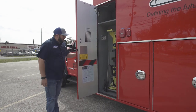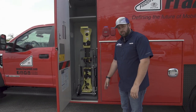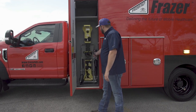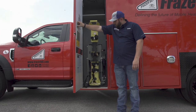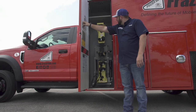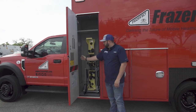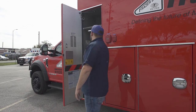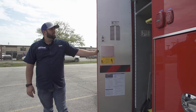The forwardmost compartment has the Zico electric bottle lift. So again, this compartment is also dropped 4 inches from standard, makes that a little less travel movement with this, but you just flip this up, hit this button, and this goes all the way out to the ground, load your bottle, bring it back in, locks it into space. Got magnetic switching, LED strip lighting here, makes this very visible at nighttime. Your CAS certifications on the door panel here.